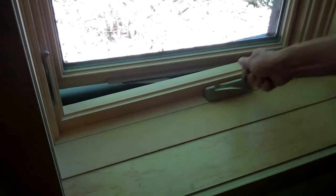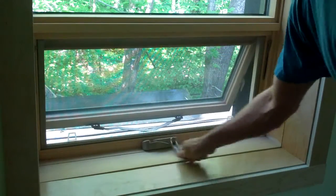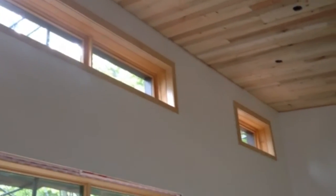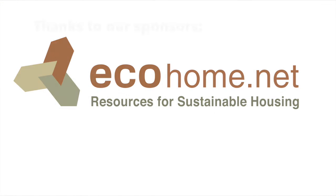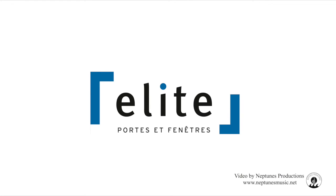An important part to remember: after you've put in your insulation, before you go to the effort of sealing it up, make sure the window opens first and that you haven't put too much pressure on it. If you warp the frame at all, you might find that your window binds. So if you set out with these goals of insulating really well between the frames, creating an air seal, and working on moisture penetration, you're going to end up with a window that performs better and lasts longer.